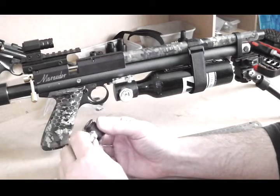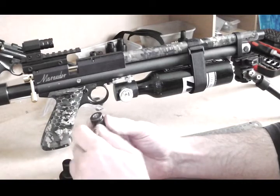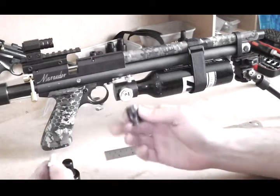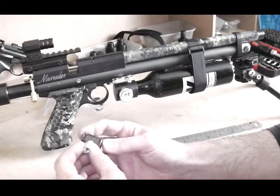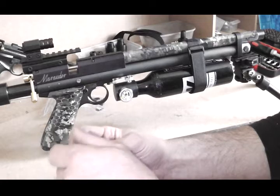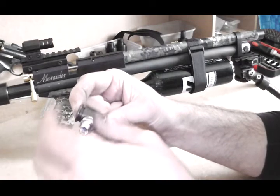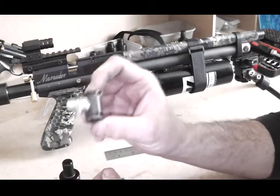What you need to do is remove your gauge and gauge port — all of it. When you look at the bottom of the tube, all you would see is the hole which this adapter is going to screw into. Depending on your gauge port, newer ones are just bored all the way through, so when this comes in it'll go in so far and then stop.